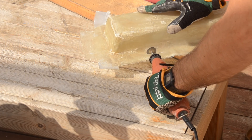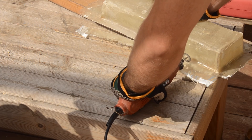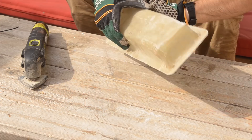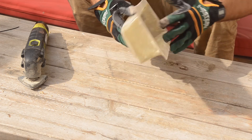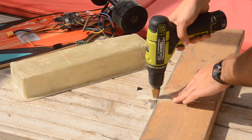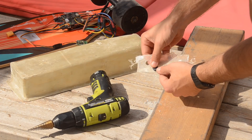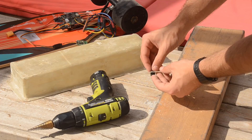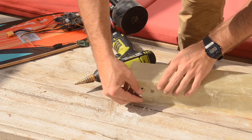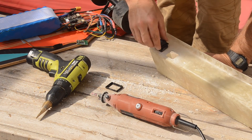Next, I used a Dremel cutoff wheel to remove the extra fiberglass on the edges, leaving a lip large enough to screw the enclosure to my board, and then I sanded that edge smooth. I confirmed the structural integrity of the enclosure with the scientific method of smacking it around a bit and rolling it on the table — it checks out. Then I used some scrap fiberglass cut off in the previous step to test how large a hole I'd need for my buttons and charge port — turns out, 12 millimeters. I used a step drill to make these holes in the sides of the enclosure, and a Dremel to cut out the holes for two on-off switches that I'll run in parallel.